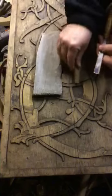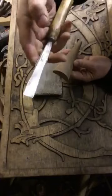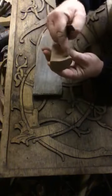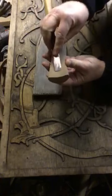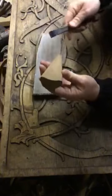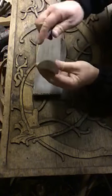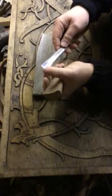I've got some more modern bits, you can get these cones for doing, this is number 3, the gouge we spoke about. You can find an appropriate cone, it's got a dish in there to get your tool on, so that helps rather than it being flat on the gouges. Yeah, it's not easy. I don't like sharpening things really. You can use these more modern shaped grinding stones with water, and the other side can do the inside, so just a few light passes to take the burr off that you've created.